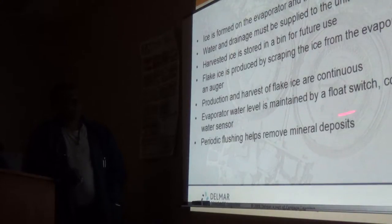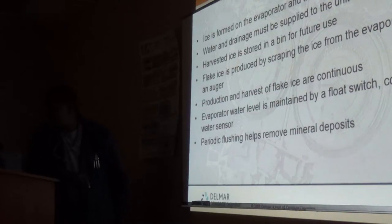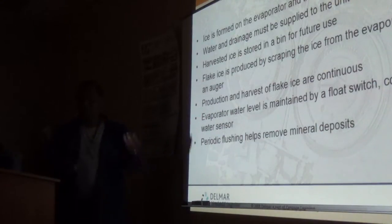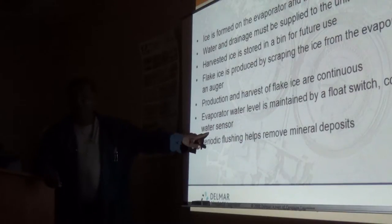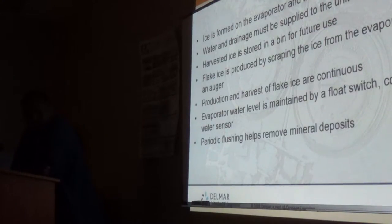And you see, these are a conductivity probe and water sensor. They work on the principle of completing an electrical circuit to indicate whether the water is at the right level. Sometimes I like the old-school stuff, where you can operate it by hand and see what it's doing. But these you can't operate. It's either good or bad. You don't have any way of really repairing them. They go bad, you throw them away, because there's nothing to recycle, or at least nothing that will get you money at the recycle place.